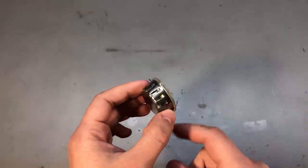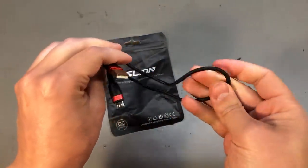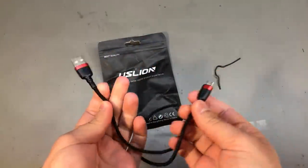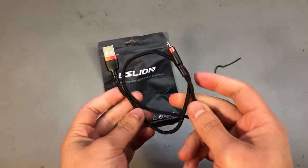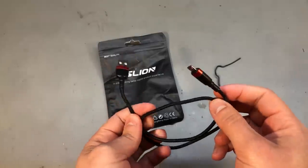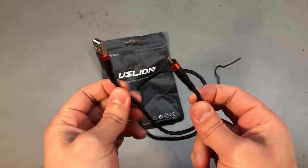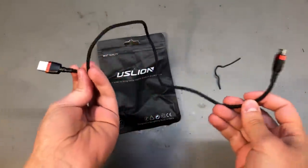Next up I have a short, quite flexible 50cm micro USB cable. There's nothing special about it — it's braided, feels like decent quality, certainly not the best but decent, and it was pretty inexpensive. I need this on my desk; I'm using a USB 3.0 hub which sits on my desk for connecting things that aren't meant to be permanent. Sometimes I connect development boards, and as we know development boards have been slow to catch up on USB Type-C, so there are still a bunch using micro USB. Such a short cable lets me connect dev boards to my computer via that hub without a long wire cluttering my desktop.